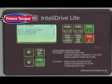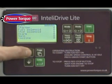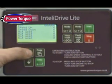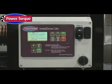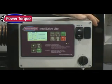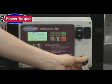We have the addition of some warning lamps for status, if fitted, though they are not applicable in this instance. Then we have the binary output setup, which shows the function and can be used for testing. We also have the binary inputs — as you can see, speed up and speed down are selected — and some analogue inputs which are not applicable here. To start the engine, simply press the start button.